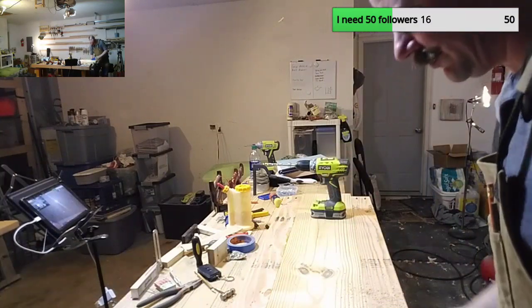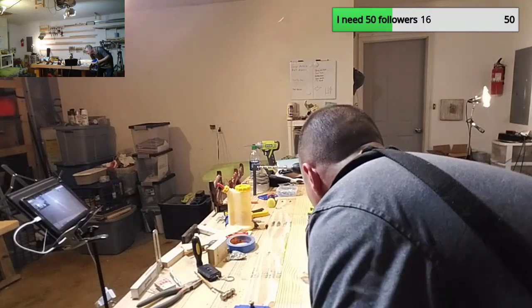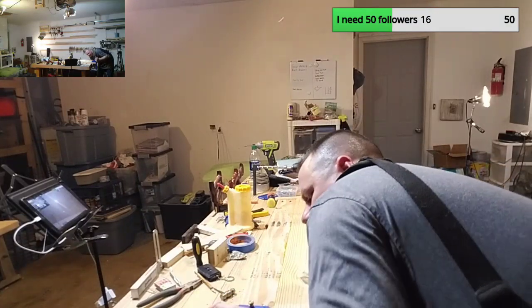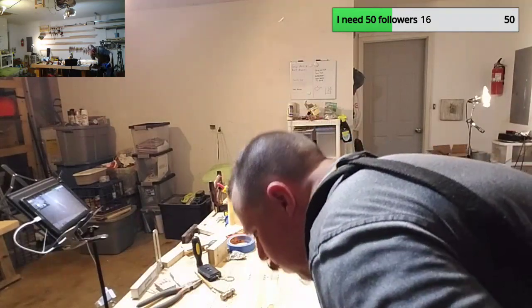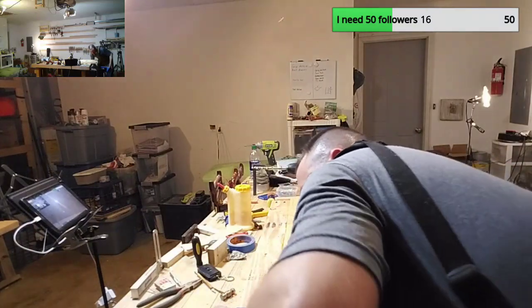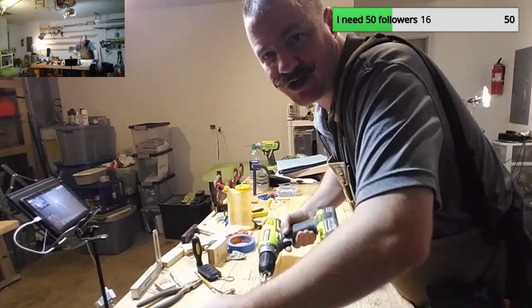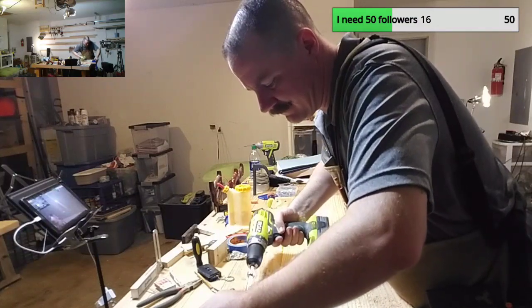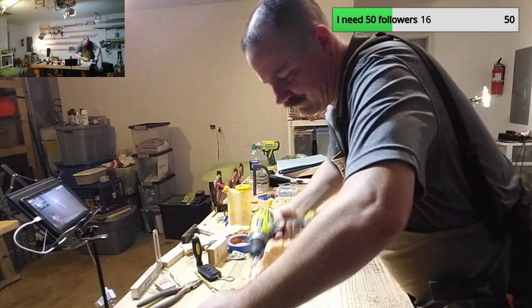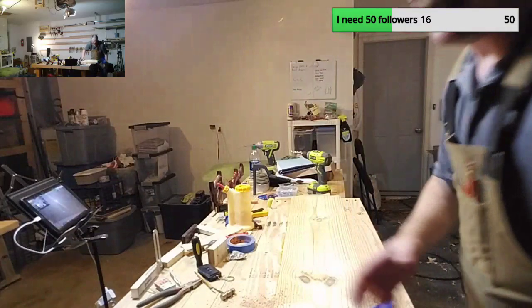We did save quite a bit on pocket holes by gluing up this lamination rather than doing pocket holes as the plan called for. So we got a lot more screws left over for other purposes. You're not clamping. Why not? There we go. Sawdust, just a little bit of sawdust can ruin your whole day. Put indentations in your workpiece and prevent your clamps from clamping.